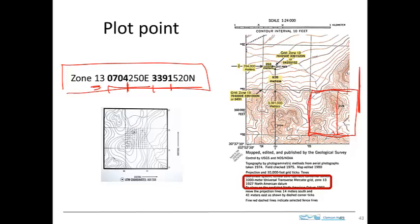The way to do it is to first go with the Easting — that's down here on the bottom of the map. There's 704 corresponding to that set of numbers, and 3391. There's 3390 and 3391. So the origin of coordinates for the block that we're interested in is right there. Then we've got to go 250 to the east, and 520 to the north of this corner point. There's 520. The 250 and the 520 are measured using the scale of this particular map.